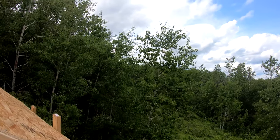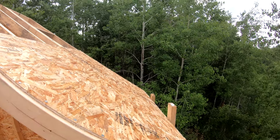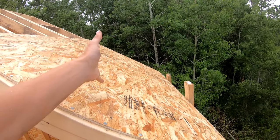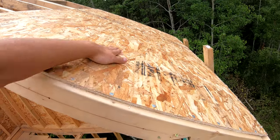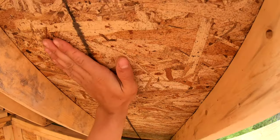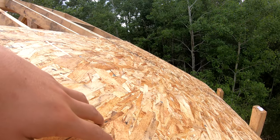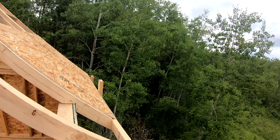We're back up at bush camp and what we're going to do today is lay the plywood down for the roof. There are two sides to OSB plywood — this is only 3/8 OSB. You really should use thicker, maybe even standard plywood, but this is what I got — I'm cheap, I'm not rich, get over it. When you look at your sheets of plywood, there's always a smooth laminated side — it's real slippery — and the other side is quite a bit coarser. You want to put the laminated side upwards because it sheds water better. With these being 16-inch rafters and a 20-foot roof, plywooding works out pretty damn good. Instead of running them vertically, I run two strips horizontally because you gain some structural integrity by overlapping them.